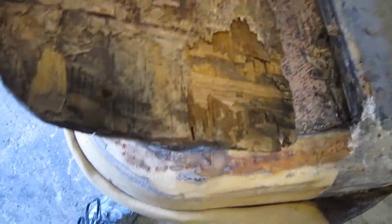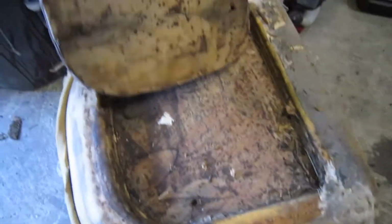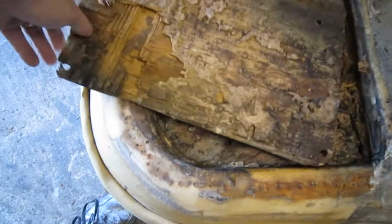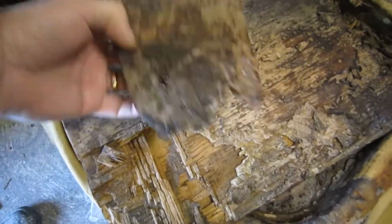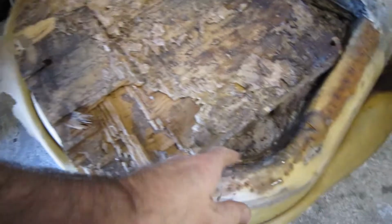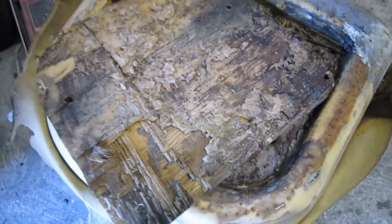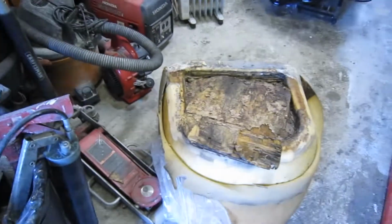And as I was poking around, I noticed that they were coming apart. And on the top side is what you see. It's nice and solid, it's good plywood. On the bottom side, they actually had this particle board, which I can find some of it here. Yeah, this particle board was on top of this piece of plywood to make up the gap between, I don't know, I guess it's about 1.25 inches or something like that. So, what a mess. They both got to come out.